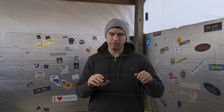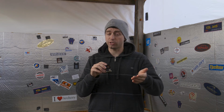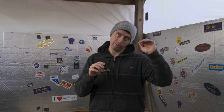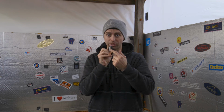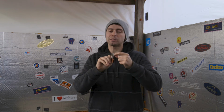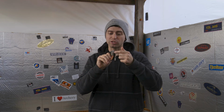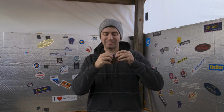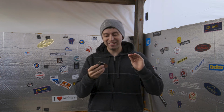Then you're gonna have to go to your Home Depot or whatever to get the aluminum brazing rods to actually weld together your shelf, because you're gonna have to cut your shelf in order to flip it upside down and then rotate it so that it actually works. Because this part here, the top, was actually the bottom. This part that looks more like regular aluminum and not burnt aluminum is actually where the shelf's little neck used to be, that allowed you to attach it to the right-handed tab. That all had to get flipped around. So it's quite a process.